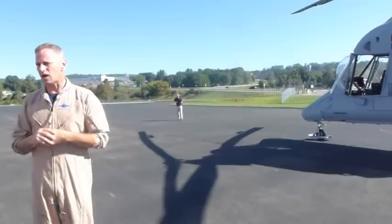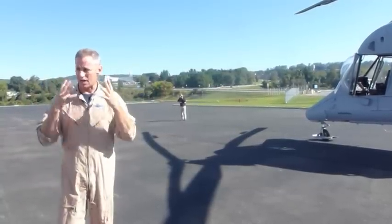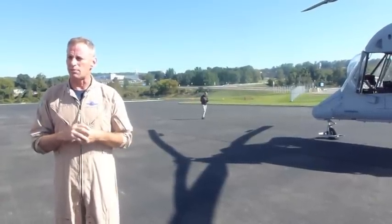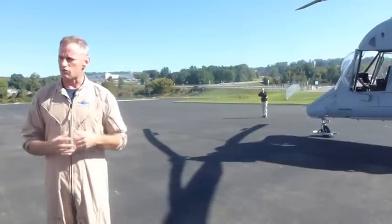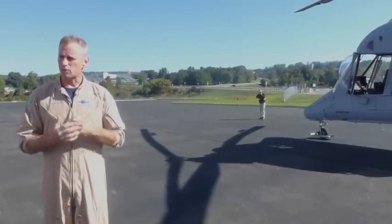We went out to Leadville, Colorado and did a bunch of testing in one aircraft. We had an oxygen system installed because we were flying that high with heavy loads. So it's very, very capable of keeping on going up there. Because the engine is so overpowered, it's kind of loafing along normally, so it's got a huge high and hot reserve built into it. It's been up to 20,000 feet.